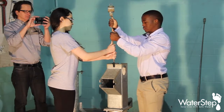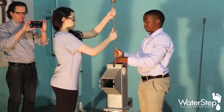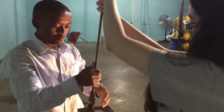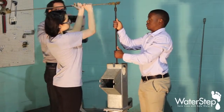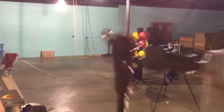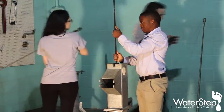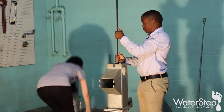Go ahead and do a hand over hand and raise this up and you will see the first juncture where the two sucker rods come together. This is kind of a unique attachment. So what you do is you just hold and support the bottom sucker rod, bend it over and then it just pulls down and slides out. Lay that one down or hand it to someone, because we will use these in just a little bit.